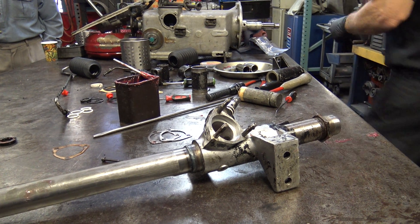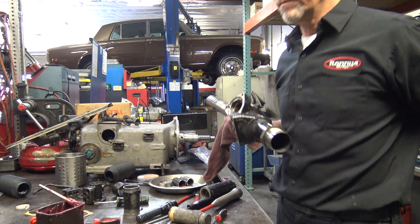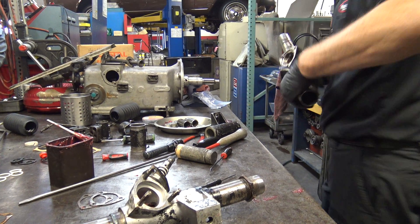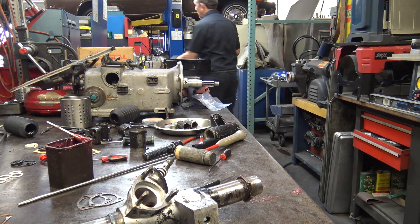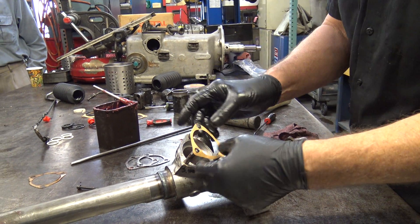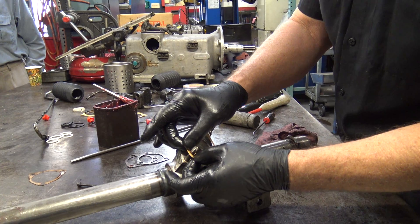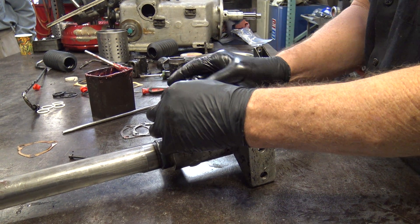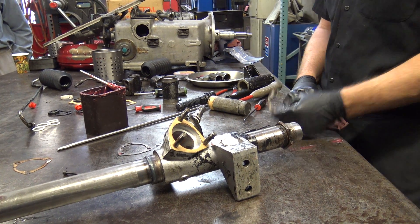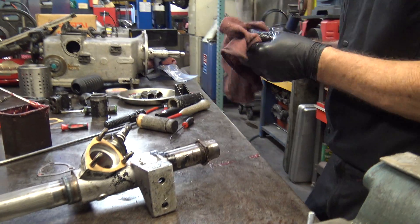For the later racks, if you look at it, they have bolts. This one has studs. I prefer the studs because then you can stack all those things on there — it's really hard to get them all lined up on the bolt version. These paper gaskets are there just to keep out water and such. I'm putting this on nice and gently because they rip very easy. They put a whole stack of shims and just put a paper gasket on the top of it — in between there's no paper. I never did get my head around that, but I'm not an engineer.